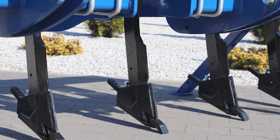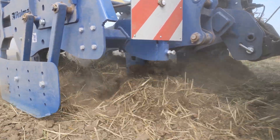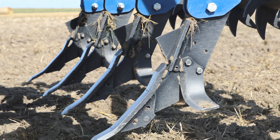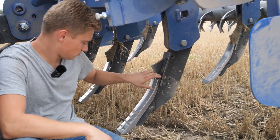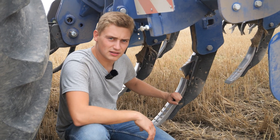The Atlas tines of the U-638 and U-632 subsoilers are characterized by the highest wear resistance, possible due to the use of the best materials such as cemented carbide. The ripper tine of the U-624 chisel plow has a special design which allows for smooth, gradual penetration of the soil structure. Side cutters allow for a wider opening of the trench, enhancing the effect of water infiltration. Additionally, the tine is equipped with a central cutter in the shape of a shark fin, which allows easier penetration of the soil's upper layer and reduces resistance posed by the tine shank while simultaneously protecting it.